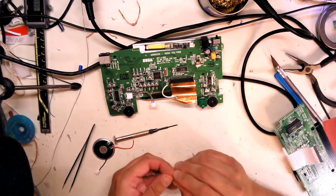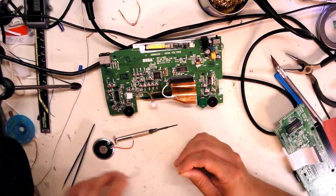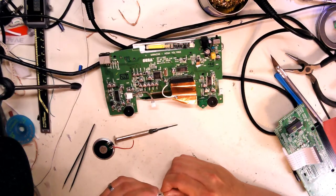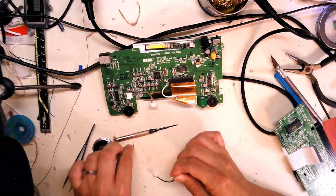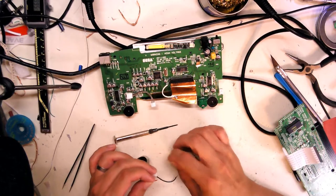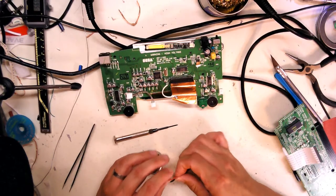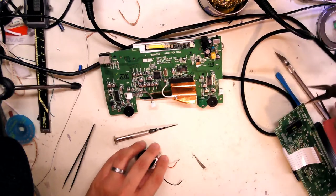So these are little tiny tabs that the wires go into. One side, of course, accepts the little square header pin there, and then the other side is what the wire goes into. So let's see if I can get it in there and give it a little bit better crimp. Otherwise, a technique I always do when I use crimp connectors, I hit it with a little bit of solder just to get a really good mechanical connection.